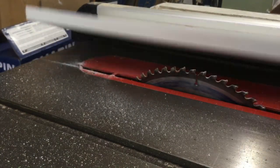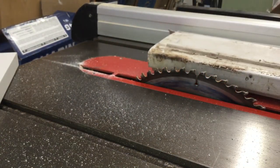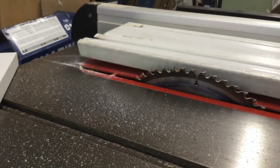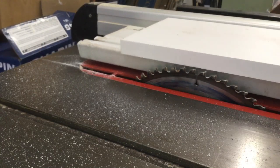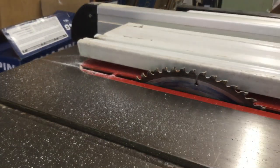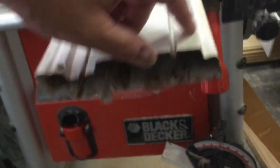First cut. So then we'll take this big piece and turn it over. Take my piece and turn it over. So you want two parallel sides. Bring that edge all up to the saw blade to get your width. And you can see my taper, not much of a taper, but you can see a little bit of a taper. Okay, so take that out,